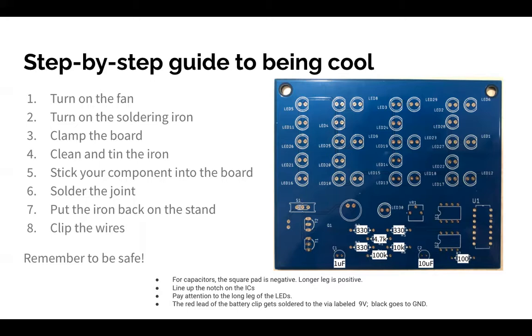And then the resistor values are on here, but the resistors are also not labeled. So we will help you clarify. But you could start with the 330 ohm resistors, because everyone should have gotten those in a little packet of 3. So if you see 3 resistors connected to each other, those are the 330s. You can start on those. Okay. All right.